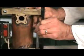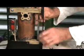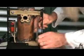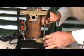This is the hole that feeds the center channel. And we want to have the top of the sight glass below that hole and seated in the bottom. A lot of people worry about breaking the sight glass as one of their premier things, but with this system, it really makes it nice because you just push it down with your fingers. You don't have to use a tool or anything like that. You make sure it's all the way down, and then you align the stripe to the back, just visually.